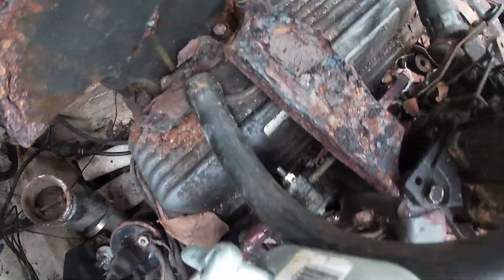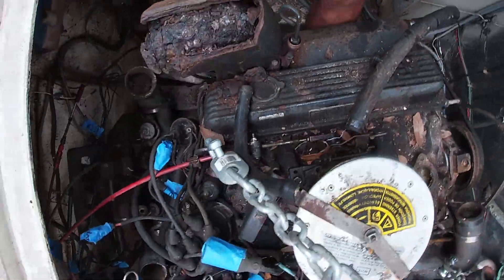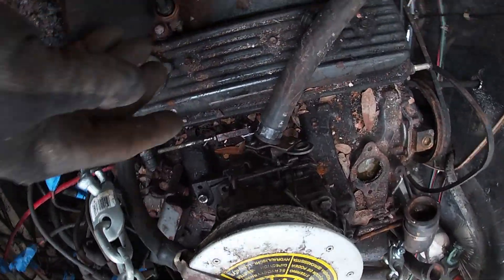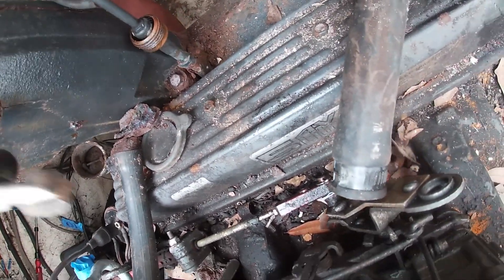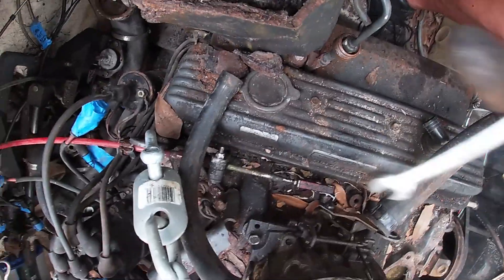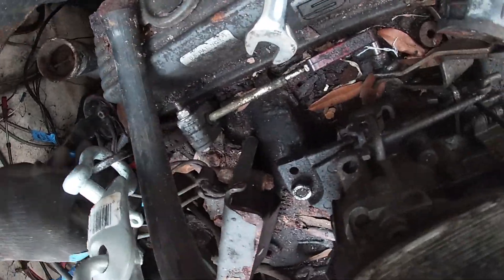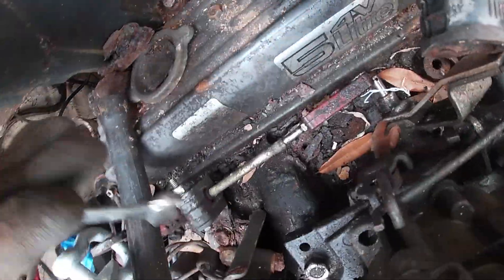I think that's free. Oh wait, yeah — what about this red wire over here? I hadn't seen it yet. I know it's got to come off. This I waited intentionally — is that the transmission? Get the throttle. All right, let me get this throttle loose. All it is — a little cotter pin and then a little nut there. That's it. So this is a 3/8 — just loosen it. This just holds this whole cable in here so that it can slide in and out. These are pretty easy to replace.